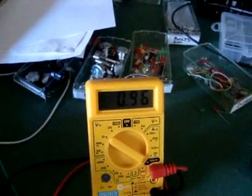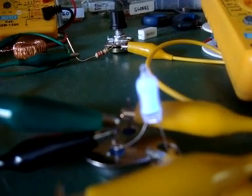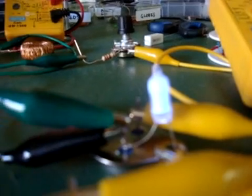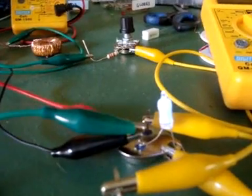At the moment we're pulling in almost an amp. By the way, it's set at six volts. What's interesting is between the emitter and the collector of the power transistor — this is a 2N3055 — you can get one of those 90 volt neons to light.